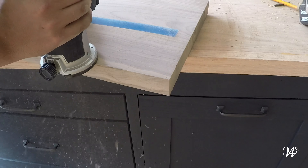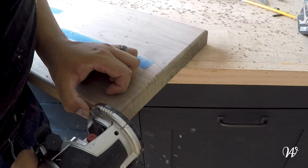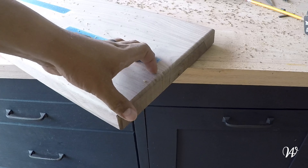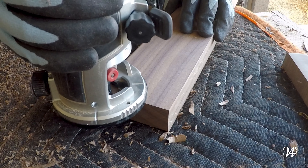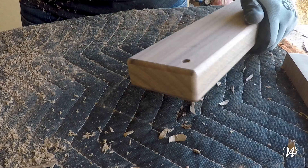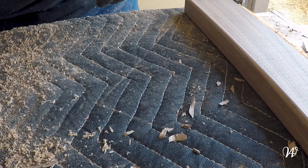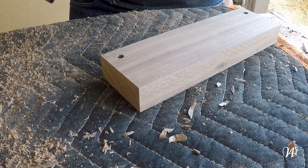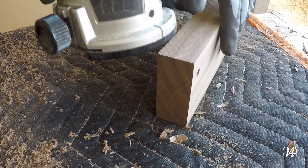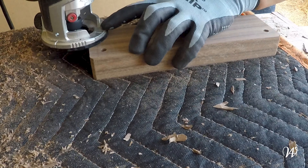After I was done getting all of my holes drilled, I figured it was time to add some roundover. There wasn't a whole lot left to do on this project and it didn't take any time at all. So I rounded these edges over and then I took my shelves and rounded those over as well. Just remember that when you're rounding these over, you don't want to round over one of the edges — you want to keep one edge with nice crisp lines. That's going to be the edge that you do your glue-up on against your main board and where your shelf is going to sit against it. You don't want that end to be rounded or you're going to have to recut your shelves and probably double the hour and a half it takes to make this project, which could be devastating.